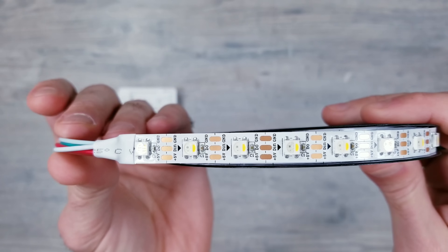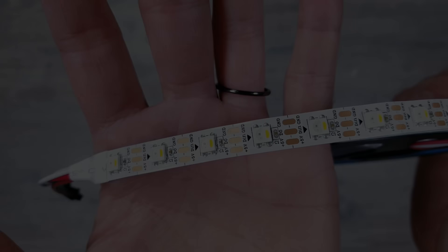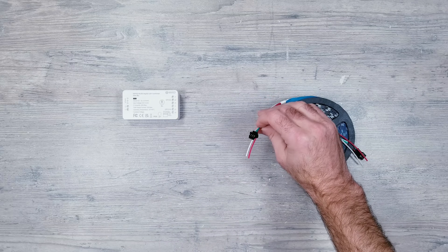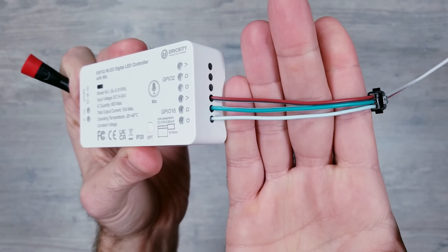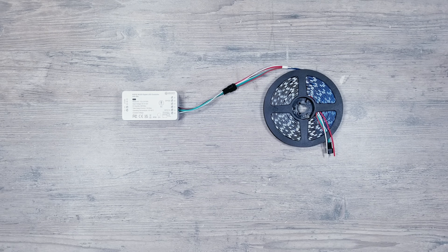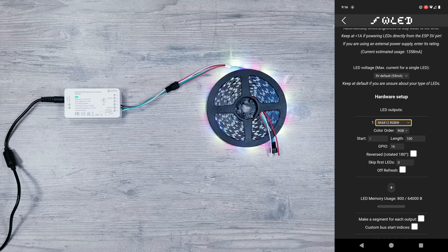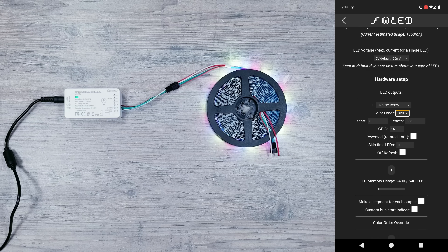Finally, let's go over getting SK6812 lights up and running. These are the same lights I used for my gaming setup, which I'll leave a link to in the description. What's special about the SK6812 strips is that they come with a separate dedicated white diode, so these are much better at producing a good-looking white compared to the popular WS2812B variant. The beginning of the strip is on the outside, so I'll quickly get the JST connector attached and the three wires connected to the controller — the same three-wire configuration as the COB lights. Since these are 5-volt LEDs, you can't use the 12-volt power supply; use a 5-volt 10-amp supply instead. In LED Preferences, change the LED strip type to SK6812 RGBW, set the length to 300, and change the color order to GRB. Hit save and you're all set.